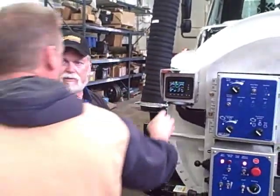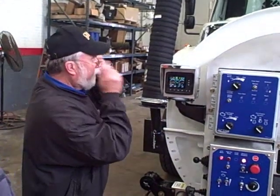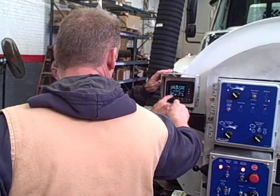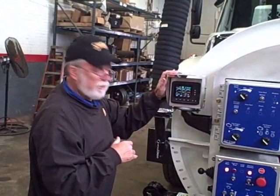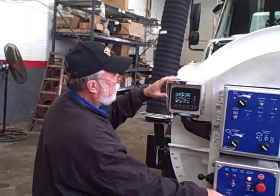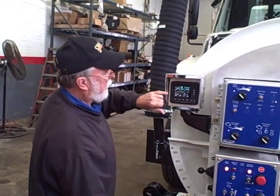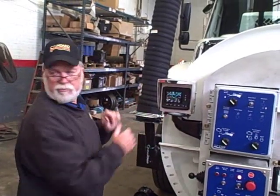No more messages — we can start, we're ready to run. If anything is like that, it'll give you the message and it'll come up and say okay. You press F2 to go to the next one. If you have multiple messages, you'll have multiple F2s. It'll keep banging through it until your screen is clear. So that's the first thing you check — if it isn't going to start right away, look for a message.